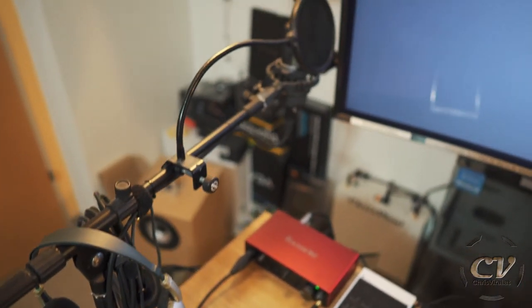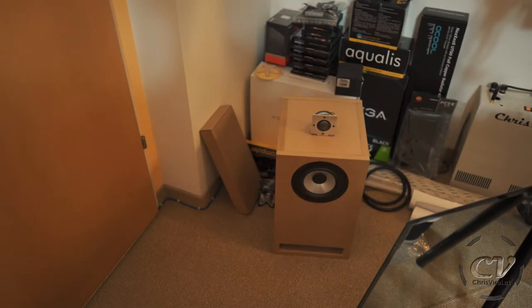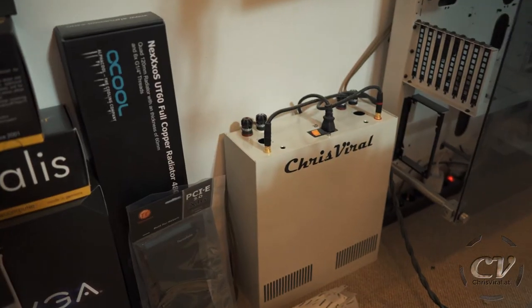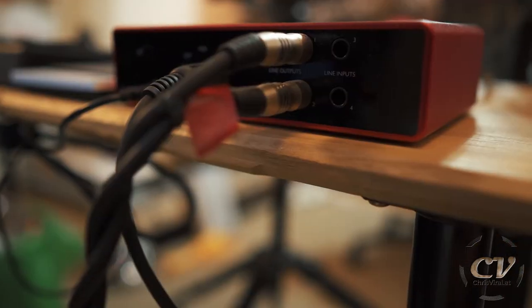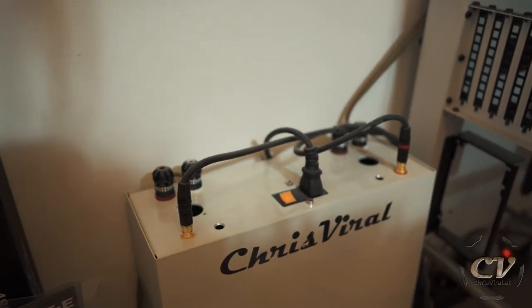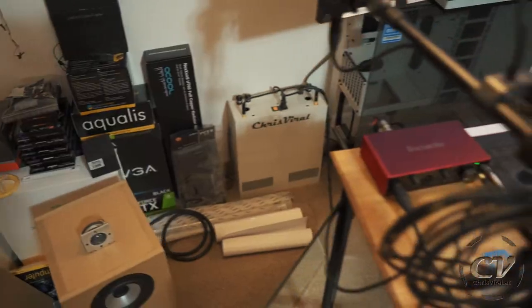The monitors and microphone — that's a condenser microphone, so I need to press this button, but I will get to this later. My boxes are passive speakers, so they need an amplifier — which is DIY, by the way. An amazing amplifier, 200 watts. This amplifier is connected back here to the mono outs, one and two in the middle basically. Left and right cables go into the amp, and then from the amp there is a hot and cold wire going to each box, each monitor. So that's the basic setup right there.